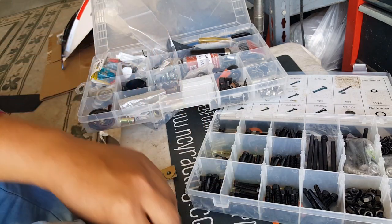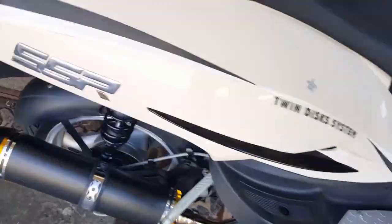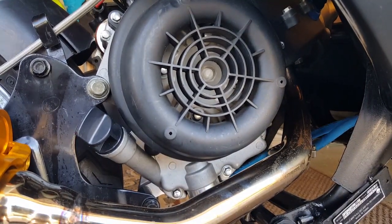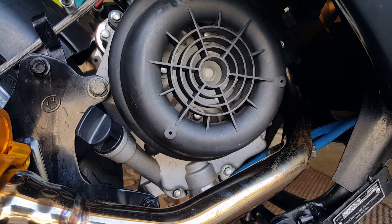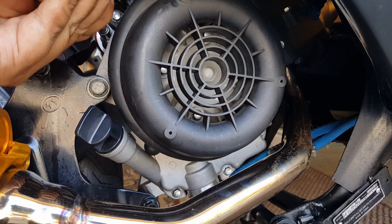While we're doing that, let's go and remove the other guy here. So let's take him out quickly and see how long. Okay. You know, one comment asking: I took out all my stator bolts and I don't know which bolt goes to which. I wouldn't try to be perfect really, because nothing in the GY6 is precise. Sometimes they give you whatever's available too. So don't sweat it, because usually people like myself take these regular hex bolts out and exchange them for Allen bolts, so it's not like they're going to be accurate, right? So we're going to do that just like I just talked about. You want to torque them back to about 5 to 7 foot-pounds.